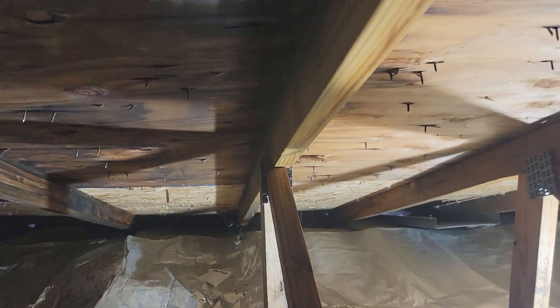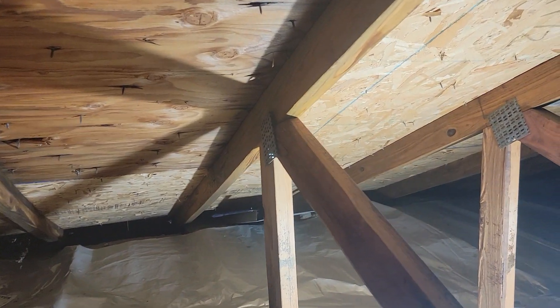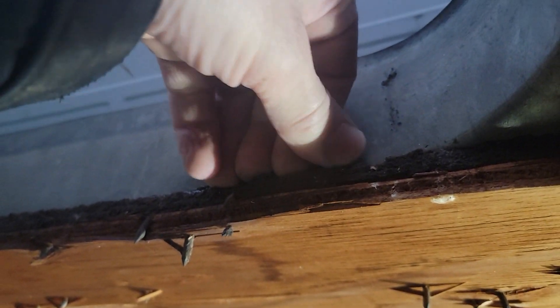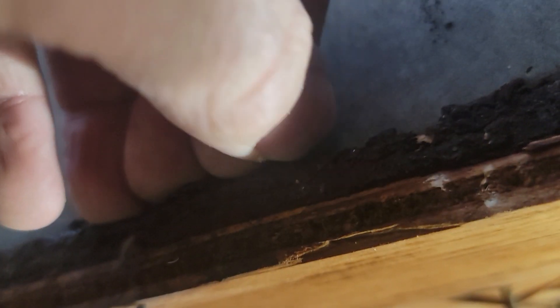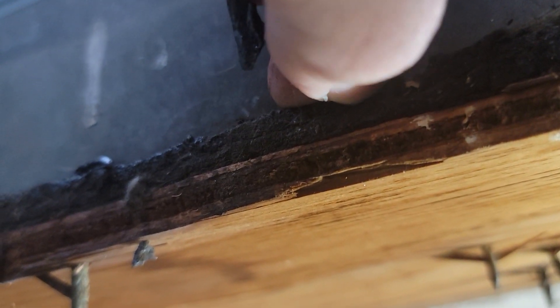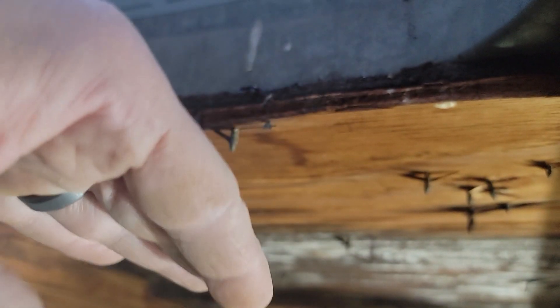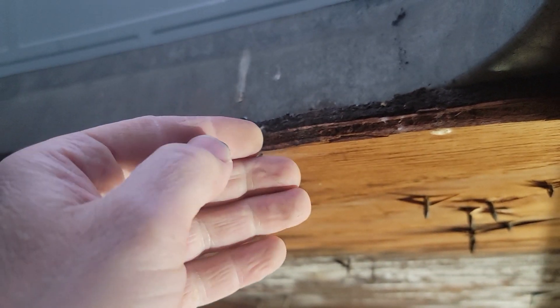Unfortunately I can't get on the roof because it's covered in snow, but my guess is something's not tucked right. The water starts just below the chimney casing itself, right where the flashing flange should go down — you can see a perfect line, and it's just about the width of the chimney. They replaced a little bit of wood but didn't replace this area — it's been going on for a while. I'd bet a paycheck that they simply have the flange nailed down, with an older layer of shingle under the newer roof.